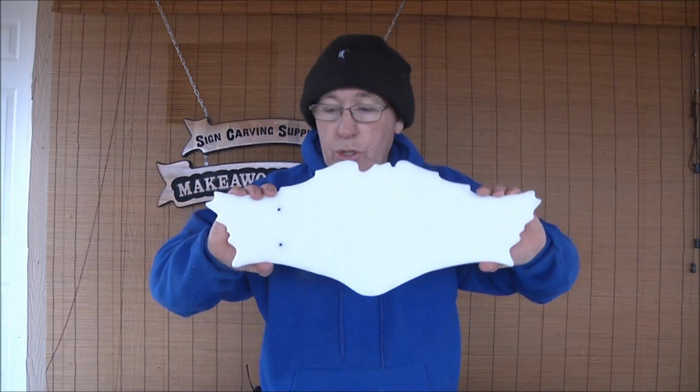Just make sure before you start cutting that it's nice and solid and there are no gaps in there. You want to pick a board that doesn't have a lot of cup on it, so all of those screws bite nice and good into the back of your sign. That's all I can think of right now, guys. I think that's all the notes that I had.